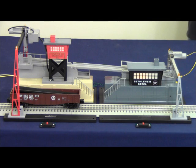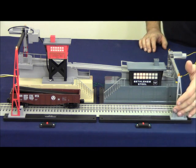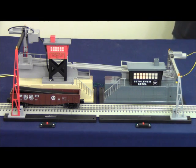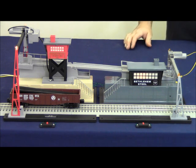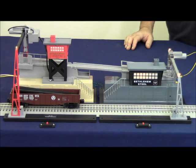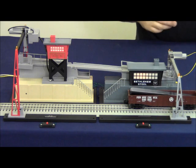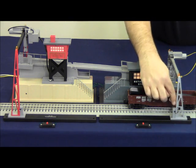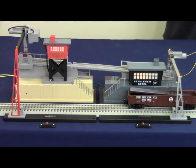It's important to note that the infrared light sensor is located out on the post, with the spectrum of light sent from the base. It is possible for ambient light to affect the receiver on the post. The best way to check is to place your hand between the base and the outside post — if the lights flash when you do that and stop when you remove your hand, ambient light is the issue. The easiest fix is a small piece of electrical tape, or you can paint the side of the eye with gray paint matching the accessory. Just be absolutely certain you don't cover the eye entirely, or the lights will flash all the time regardless of whether a car is in position.